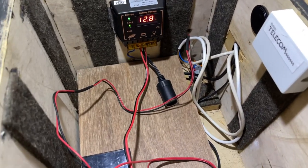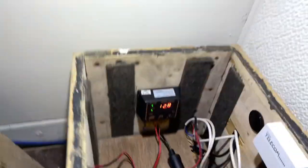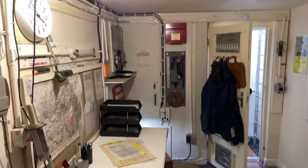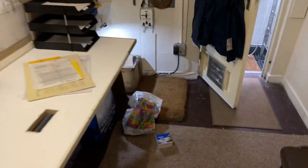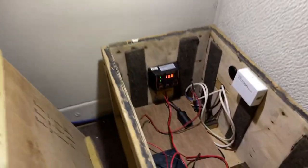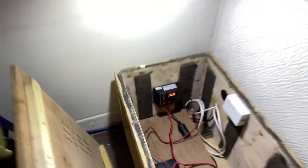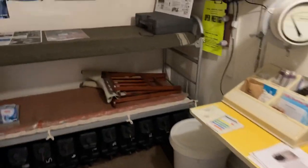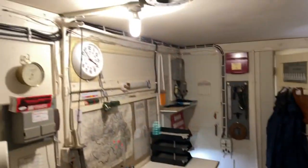That main power connection will power all the lights — I have that hooked up at the moment. I'll go and turn on the lights. As you can see it's reasonably dark — and there are the lights on. So that's everything being run off grid at the moment, which is pretty cool. The battery is actually not 100% charged — the voltage has dropped right down to 10.8 volts, so that battery needs a really good charge. I just grabbed the first SLA battery I could find from the house.